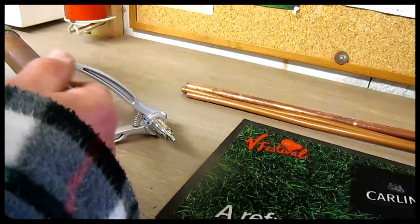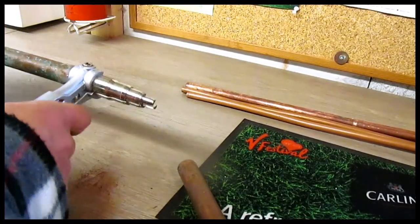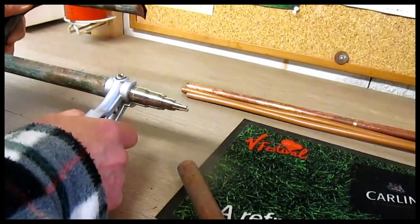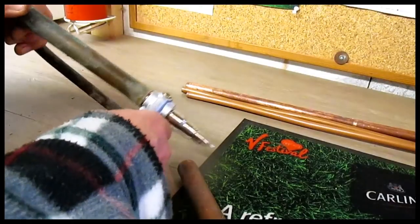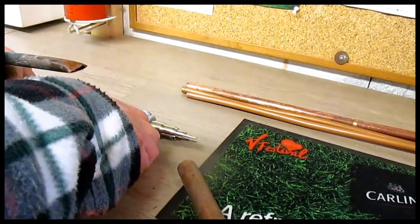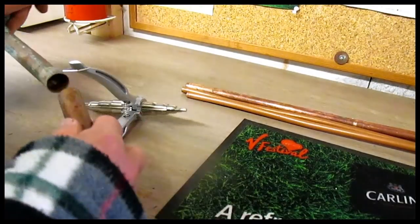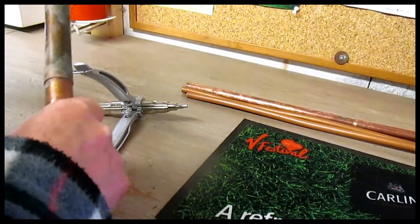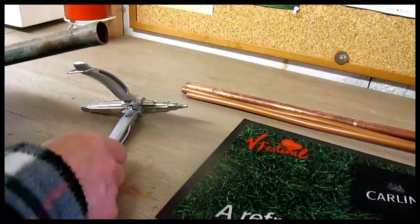Let's have a look at that. Right, well it's going there - almost there. So inside a few moments. Another good thing with these: if you come across old three-quarter pipe, you won't need to go rushing off buying a three-quarter to 22mm adapter - you make one. We're not quite there yet but we're getting there. So let's just try now the annealed piece of 22mm copper which I've got on the side.